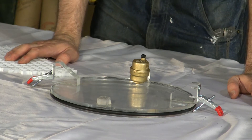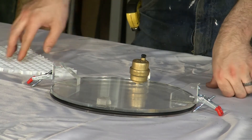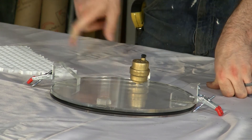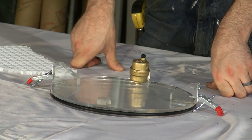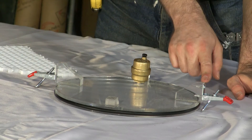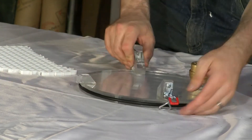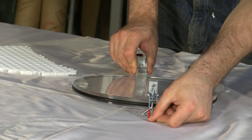This size O-ring can be purchased readily off McMaster-Carr or any other O-ring source. I did, in fact, make this one out of O-ring stock I had on hand. Two small blocks of acrylic were cut to make the front and back stops. If I was going to do this over again, I would have put latches on all four corners — sometimes it takes a little encouragement to seal the front or back. Another two blocks of scrap were cemented on as mounting blocks for the latches. These small draw latches have a loop and a handle; they're good for drawing it tight and also for popping the lid back off.